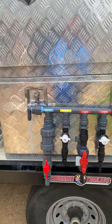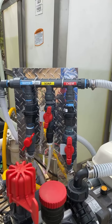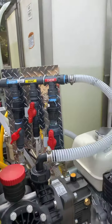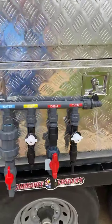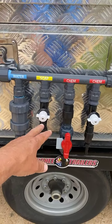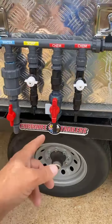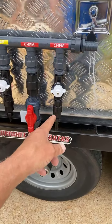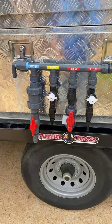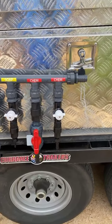This will be mounted on the plate just like the others — it'll be identical to what we already have. It'll have the back plate, but the only difference is now we're going to have to go with the four-port. This valve will work fine for your soap, this valve works fine. The reason I'm using these valves — we can go with a half-inch metering just like that one over here, but money-wise, you'll have to pay extra for two of those metering valves. We can do that, but I'm doing this as an example to show you guys so we can cut back on the cost.